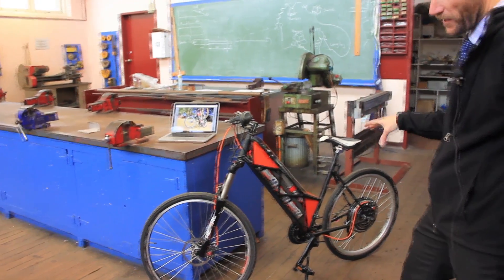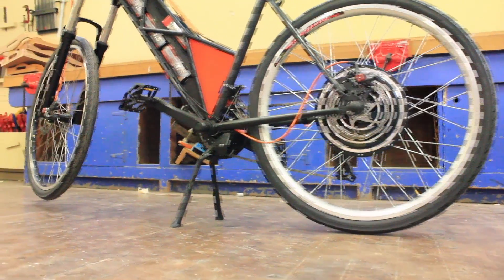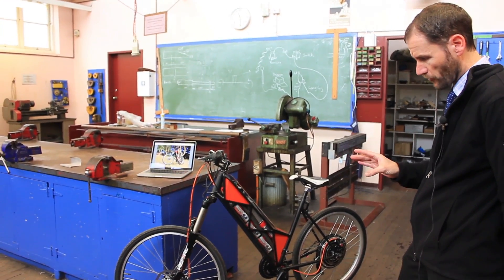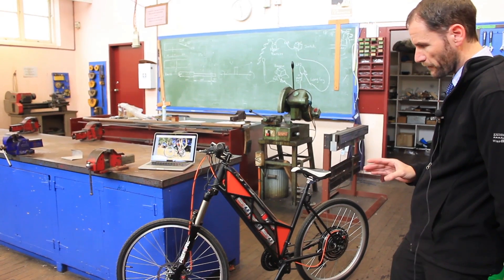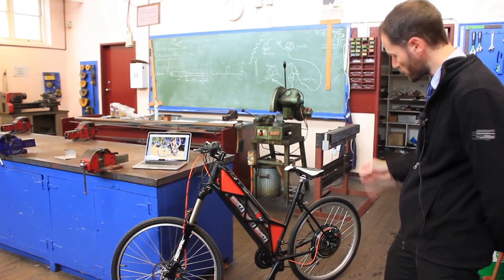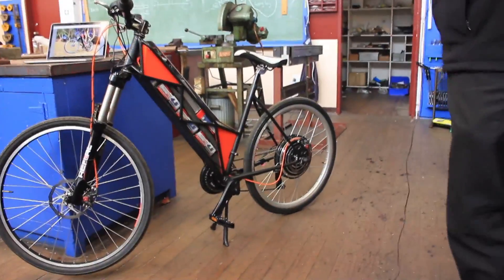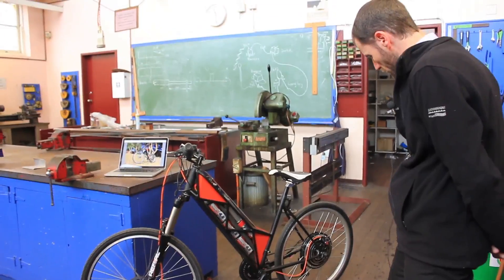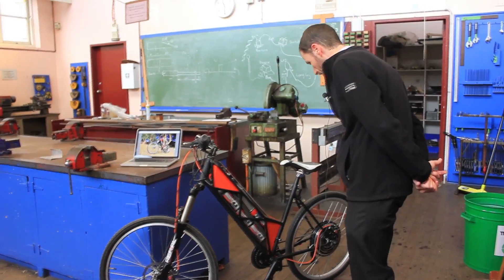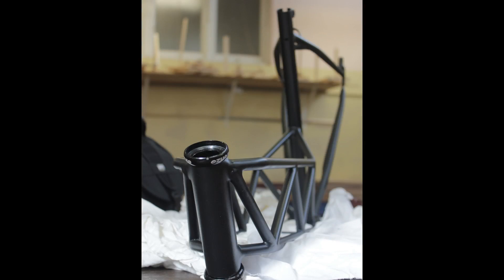The orange isn't really my favourite colour, but I like the way you've tried to fill in some areas while leaving exposed sections — I quite like that. The rear hub motor is probably a really good idea. I've seen designs with a front hub motor, but that turns the bike into a front-wheel-drive vehicle, which accelerates front tyre wear. So the rear motor is good, and you've coupled that with a freewheeling hub. The disc brakes — I like what you've done on the back fork, mounting the caliper housing onto the seat stay. I also like the step-through frame, which Alex Moulton said was much safer than a top tube.